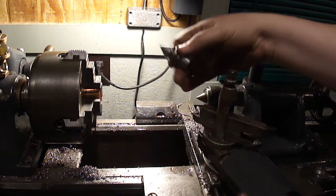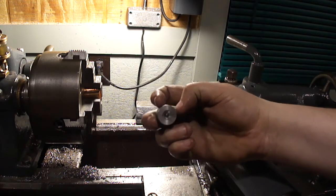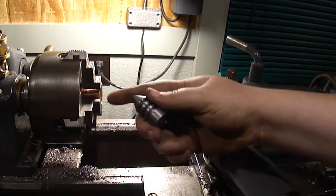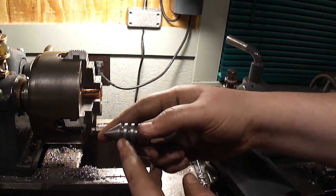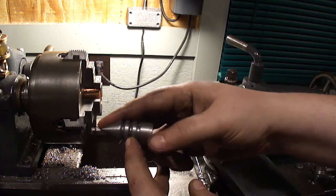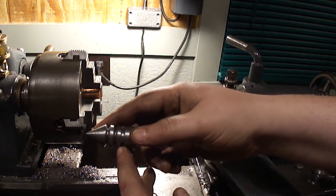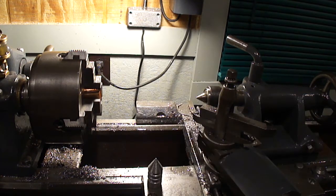I'd say that's pretty good. One of those little tools — so simple, but very handy. This one I designed so it has the 60 degree V-groove for the standard thread, Whitworth or Model Engineering thread which is 55, or Acme thread for making gear hobs or whatever. Get it hardened and okay — thanks for watching, see ya.